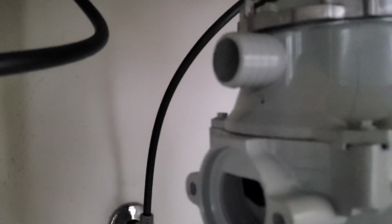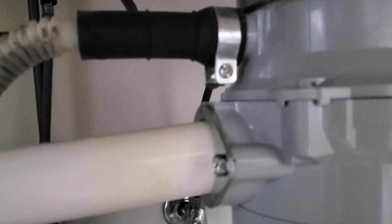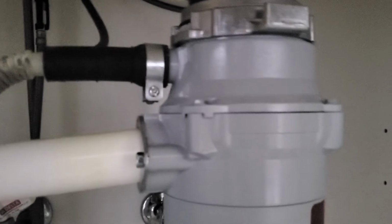If you are connecting a dishwasher, make sure you use a blunt object, and there is a plug inside this drain, and you need to knock it out if you're connecting to a dishwasher, which we are. So I'm about to line up my final pipe fittings, screw that all together, and you got to fish it out with some tongs to get it out before you plug it in. So we now have our pipe fittings fitted back. Everything is now connected, and I'm going to get out the plug from the inside of that before we plug this thing in.